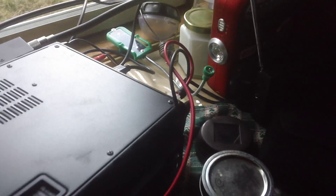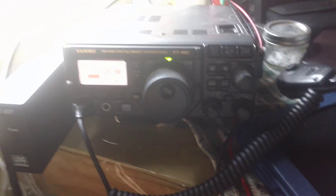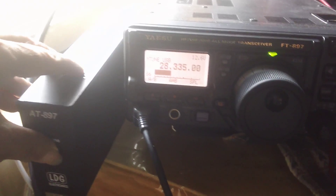There is no power supply in between here because we're running straight from the battery. Most of my radios have power poles on them but I do not have power poles on these, so we just have bare wires. I have the terminal posts on my solar generator, which is really nothing more than a battery inside a box with a charge controller, but we're just running directly off the battery using those external posts. Black wire hooked up to the negative, red wire hooked up to the positive. I do have two 10-amp fuses, one for each one, so just in case those will blow and won't damage the radio.